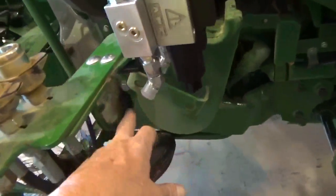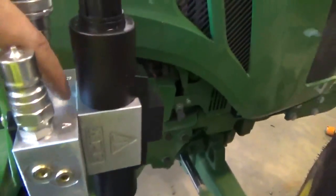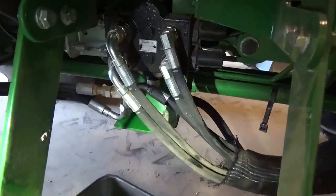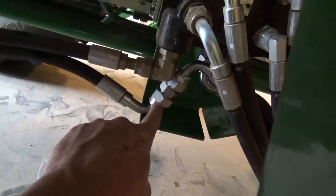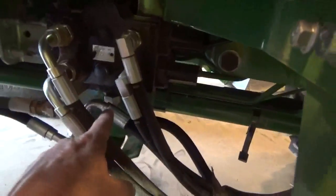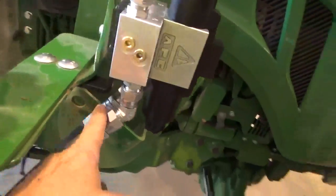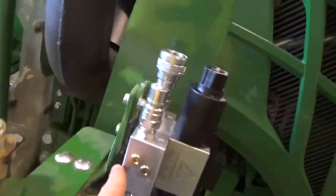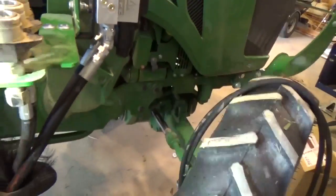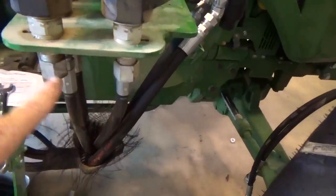Got the valve installed. It just bolts — you don't have to do any drilling. It just bolts right at the bottom of these carriage bolts on the bracket they include with it. A and B valve is up, so we're going to the next step. You connect on to the power beyond port — that one over there. You take this line off of the power beyond port and connect that line to it, then connect that line right there to the power beyond port. I just ran the lines through the hose protector all the way up here and connected onto the bottom.